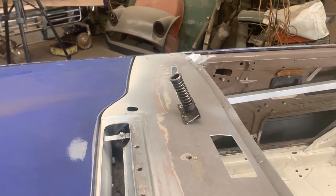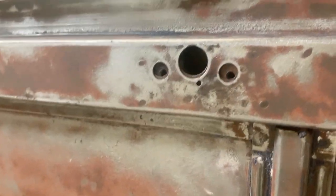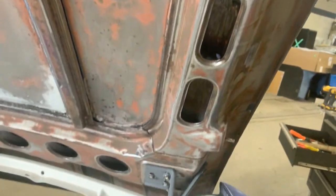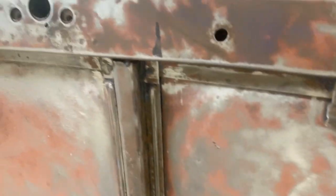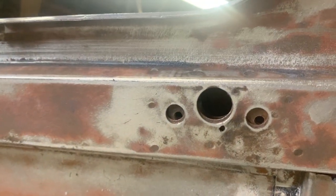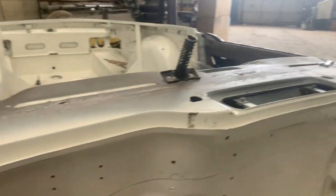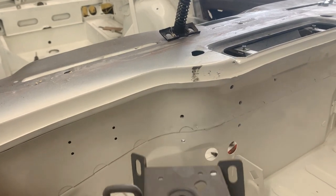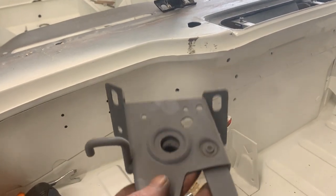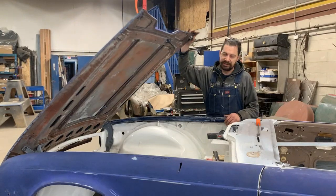Don't forget that the latch is also adjustable, and that's for a reason. If you look at the mounting point here, it has a plate like the hinges over there — they have a plate inside that moves back and forth for adjustability. This one has adjustability too, and also here the holes are slotted so they can go up and down a little bit, and we can play a little bit with the adjustment. So let's do that.